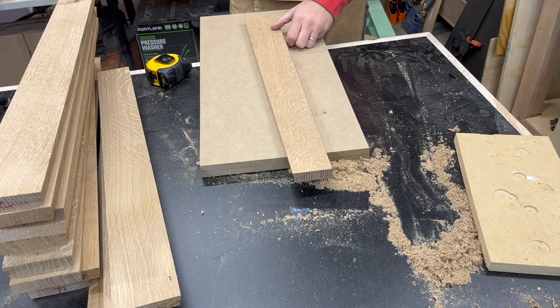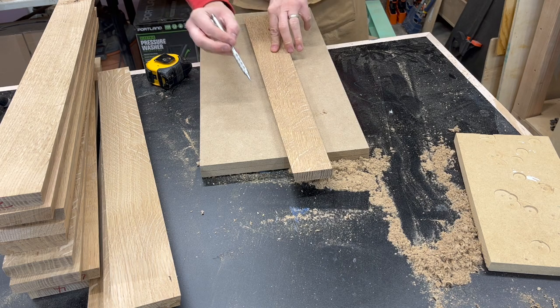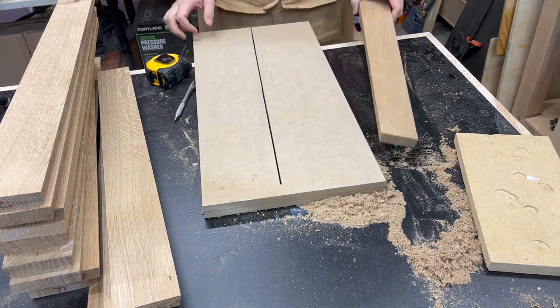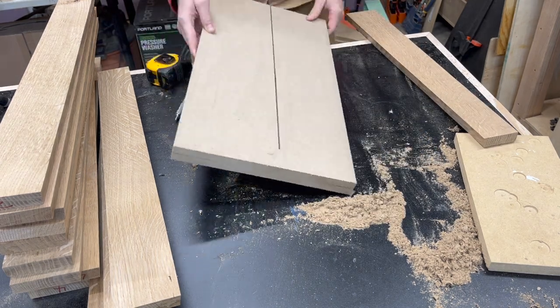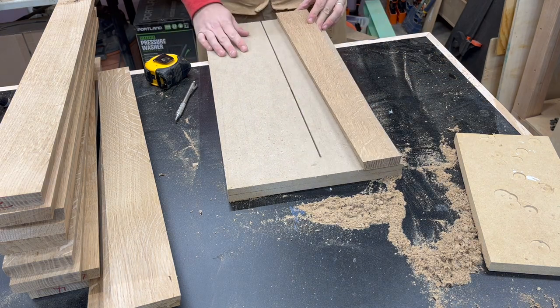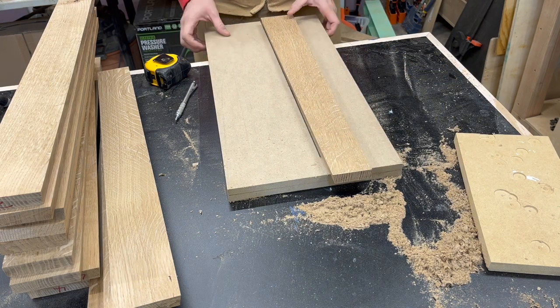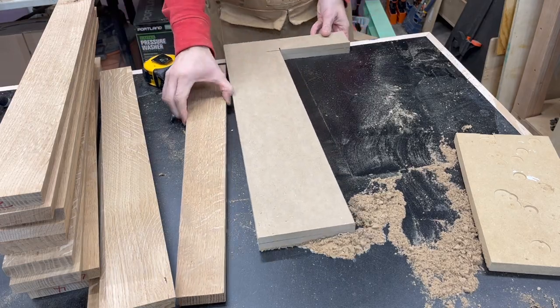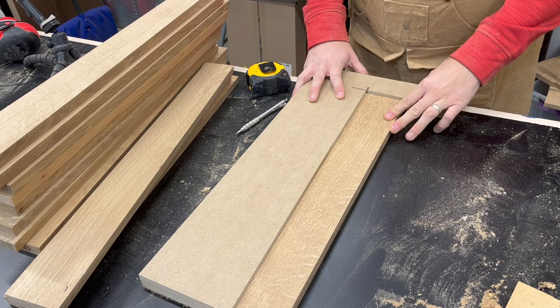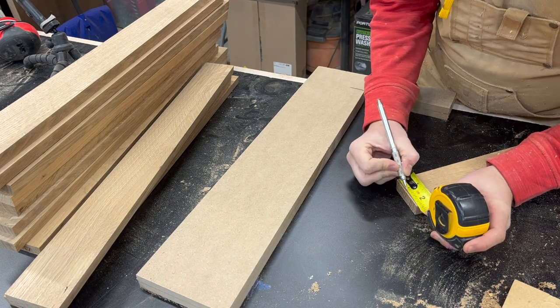Now that I have each of those boards cut on one side I can make the next jig. You just need to be careful to make sure that you're keeping the orientations correct. I need the bevel to go in the opposite direction but I need the board to widen this time as opposed to getting more narrow as it slides through the table saw. That's because on the first pass I started at the top of each board but now I'm going to be starting at the bottom, so I need to make sure I'm creating that triangular shape.